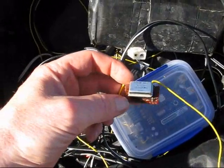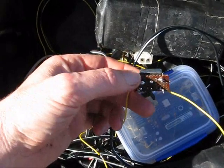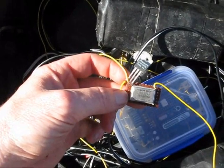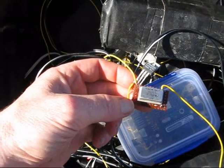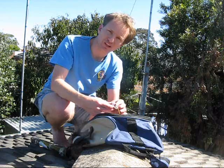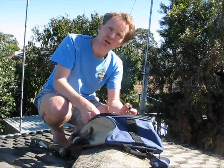The oscillator module just fits into a standard 14-pin IC socket; some others will fit into an 8-pin socket, but I've wired up the 14 so you can use either. There's really nothing to it — just the oscillator module and a 7805 voltage regulator. These modules do require 5 volts, so I'm not going to chance it by applying 12. This particular one is for 28.571 MHz, and I'll key it with the automatic CQ caller.